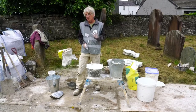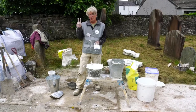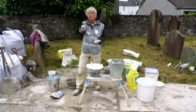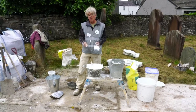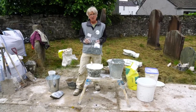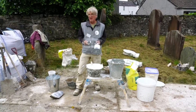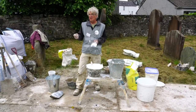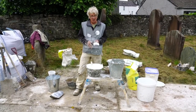And as I just said, the final coat, or if you were really assiduous, every coat, all three or all two, as it's half set, you go onto it with a dry brush and polish it, and that will create a really tight surface. And I've seen people with a hot lime wash like this. Nick Durnan showed examples where he did it on one of his buildings. You can see your bloody face in it. It's like a mirror. So you can really tighten it up, especially if you use powder lime. And Bill Revie would say that is the best way of stopping rain getting in, is really tightening that surface. Most rainwater is just going to bounce off it effectively.